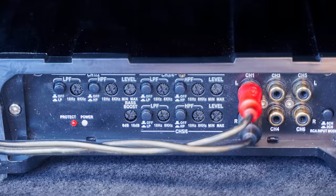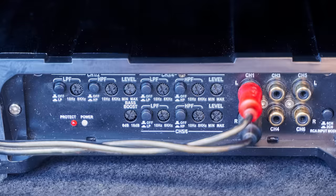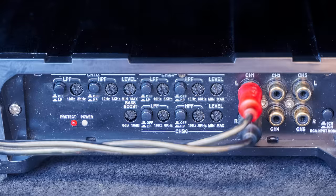Pro tip: if you're trying to fine-tune, especially your car audio, you can actually hook up an oscilloscope, play a test tone, and see at what level the amplifier starts clipping the waveform. Then you can just turn down the gain on the amp until the waveform looks good at whatever specific volume you want to be your max. This way your speakers won't clip no matter what you're playing, and you won't damage them or your ears.